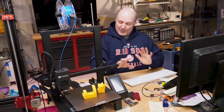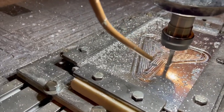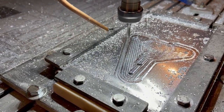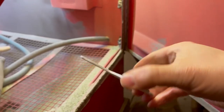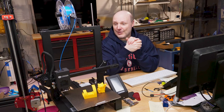It's time to make a new one. Using the Creality files, over to my buddy Fred's shop — I had some eighth-inch aluminum. We had to take a little material off the top to make it three millimeter to be identical, and basically made a new bracket. Here you can see it CNC'd. We went through and put it on the belt sander, cleaned it up nicely, then it was bead blasted. Brought it back to the house, put a coat of primer on it, left that for about 24 hours, put some black paint to match up with the printer, put a second coat on there, and I was set to go.